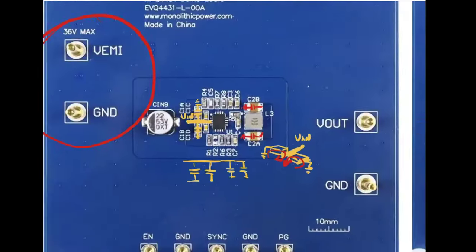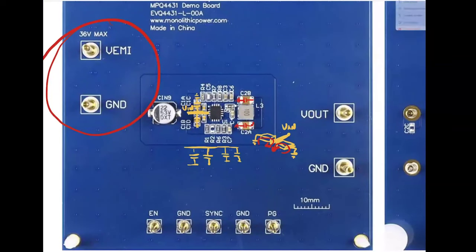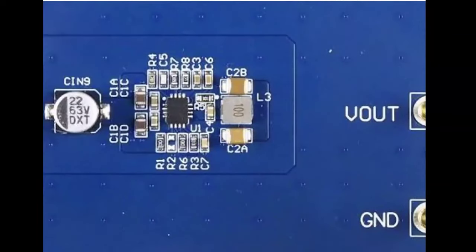Okay. The idea is that for the input capacitors, the ground terminal is here. This is the ground terminal, and this is Vin. But for the output capacitors, this is the inductance, and the two capacitors are located here. One of the things that you get with this situation is that the current that is trying to go out from your system and is able to pass through the inductor is returned in different phases through the capacitors. So this is the correct orientation.